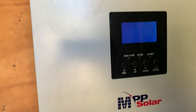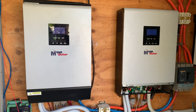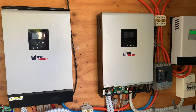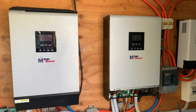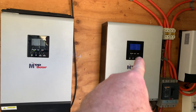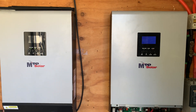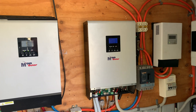I can't even turn that one off because I haven't got that one isolatable, so I've got to actually turn both of them off. That's why I put a transfer switch out there in the power box — I can just flick it over back to grid and I've still got power. And I've still got my main solar system for now. Again, if anybody's got one of those inverters, I would be much appreciative. I may actually have to take them both out and see if I can change that relay and see if it fixes it.